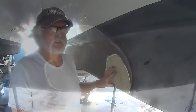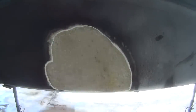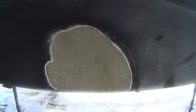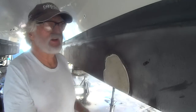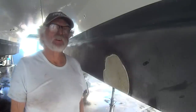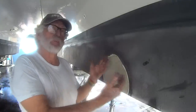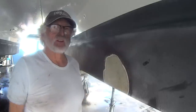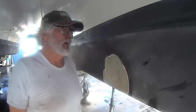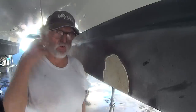in the hulls. And what's happening here, I'm pretty sure, 100% sure actually, I've got integral water tanks in the boat. So there's a water tank here and there's another one on the other side. We found a little bit of osmosis on both sides. And I think with the water on the inside, the water on the outside, I think the water from the tanks is actually leaching into the layer, because we've got epoxy on the outside of this and that doesn't let anything through.